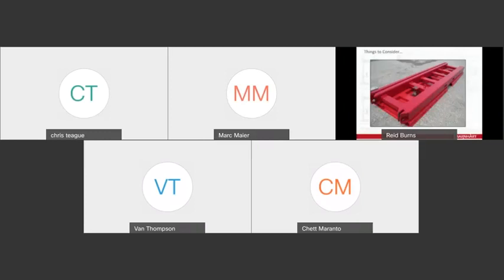And remember what we said earlier, because gantries are often a lighter weight solution than cranes, they can be much more conducive to use in areas that have a slightly lower ground bearing pressure. And so we've talked about checking the ground, that's key. There are also some things that are a little bit more particular to gantries, and so we're going to talk about those.